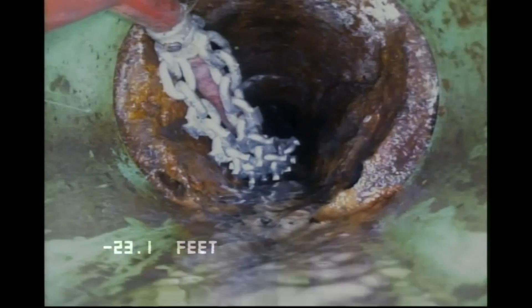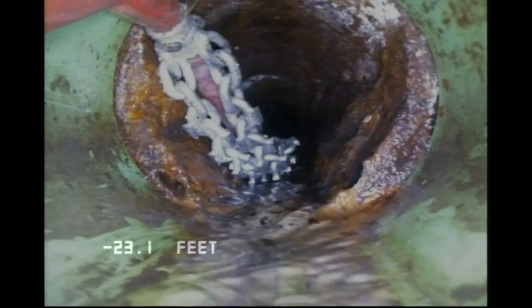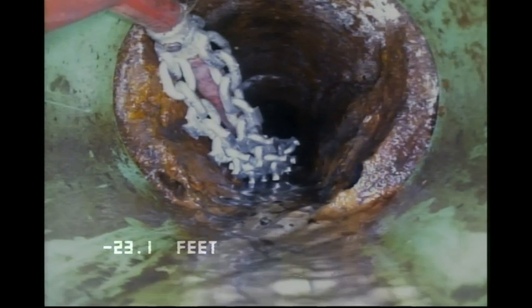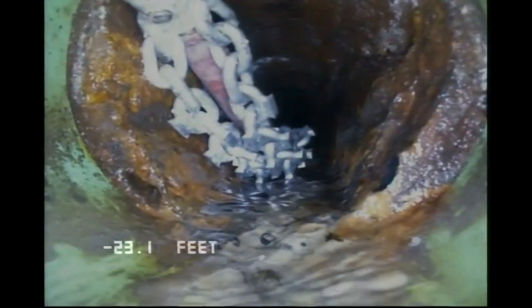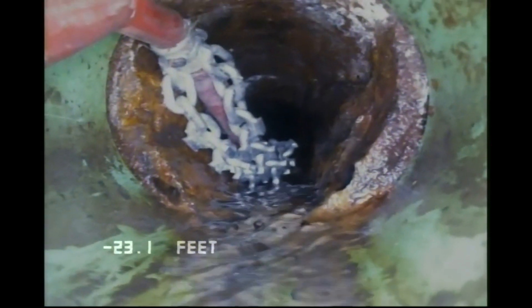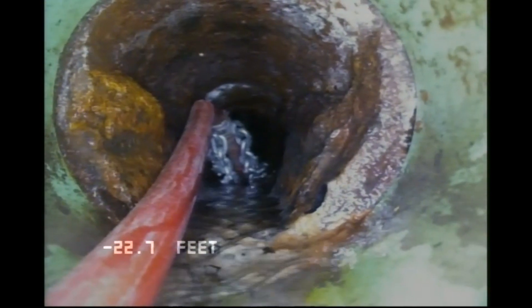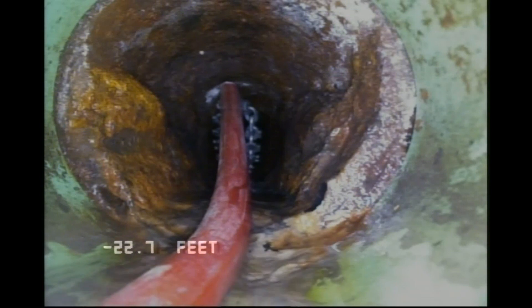Testing - July 22nd, 2021, 101 Villanova, sewer main going into the house under slab of the basement, trying to descale the cast iron. Starting a new video here on the Gnarly Carol YouTube channel. Thanks for joining along. It's going to be all pipe inspection clips. You're looking in a four-inch cast iron drain - I had that wrong about it being three inch. It does go three inch vertical up through the slab floor, but out here it's four inch.